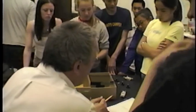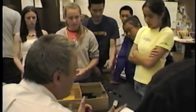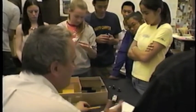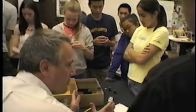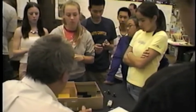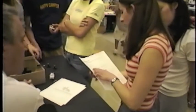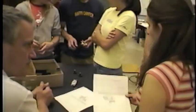So it might not be a bad thing for you representatives to get a couple of three-way switches, and while other people are working on other jobs, figure out how to wire that part up, and you can actually test it. Either switch should be able to turn on or off the light. And we need one three-way switch. Okay. Two of them.